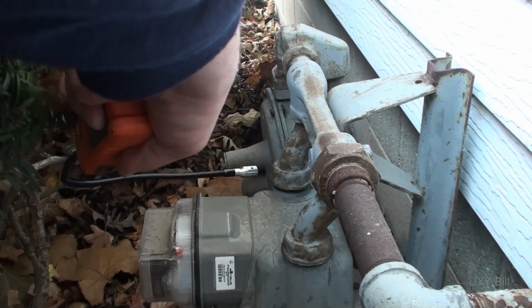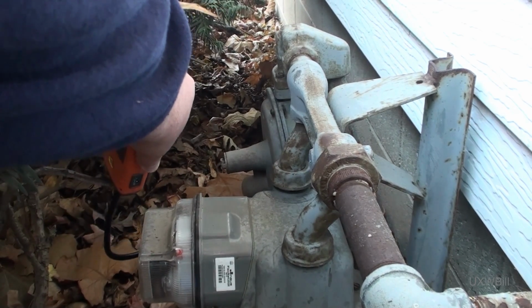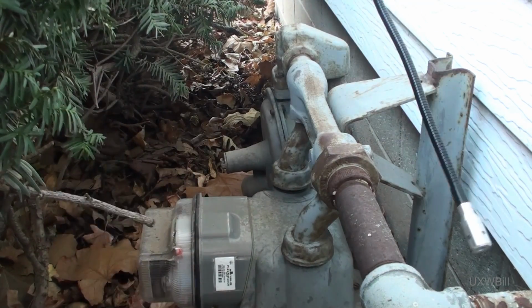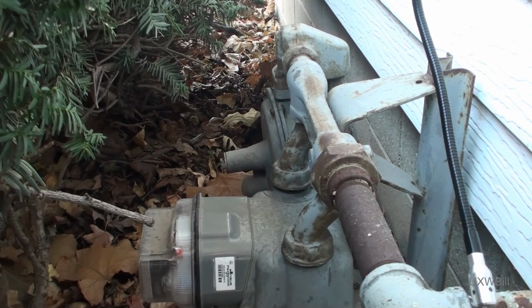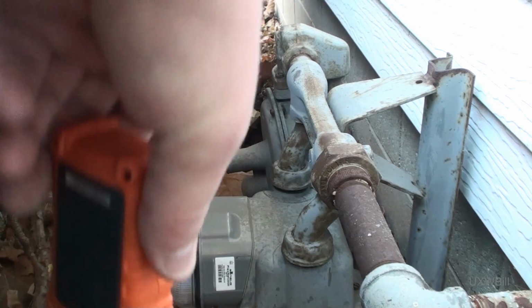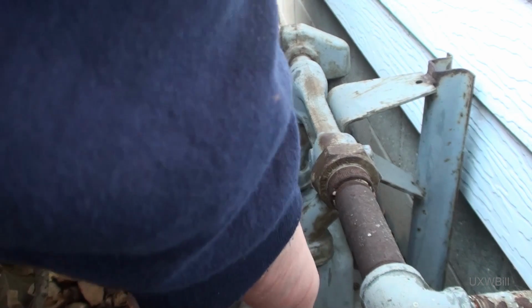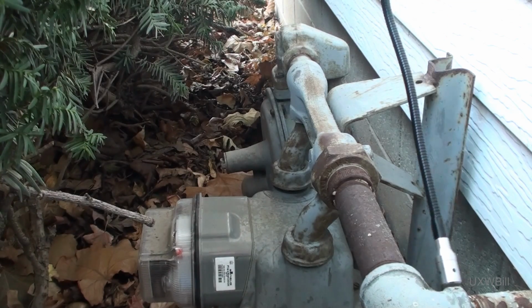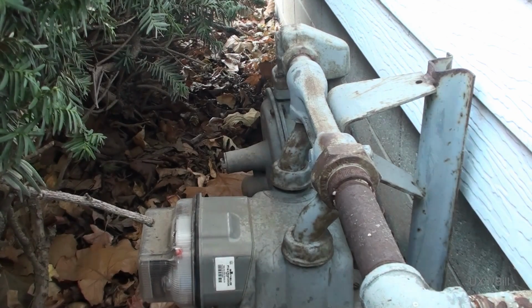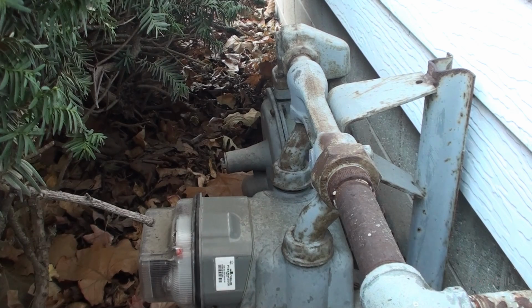I can definitely smell natural gas somewhere here. And two of my leak detectors, the two highest priced ones of course, have picked up on it. But I'm sorry to say that the TopTes models, at least two of which I recommended in previous reviews, are not giving a very good account of themselves right now. Don't get me wrong, I'm not about to say that they do not have their utility. But clearly when you are chasing a minute leak, it pays to have the better detector from what I'm seeing right now.